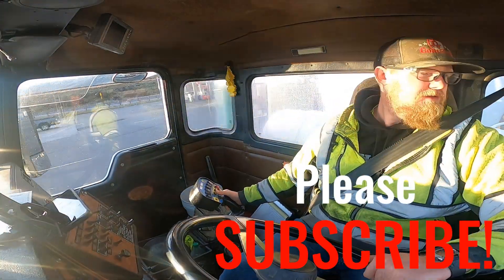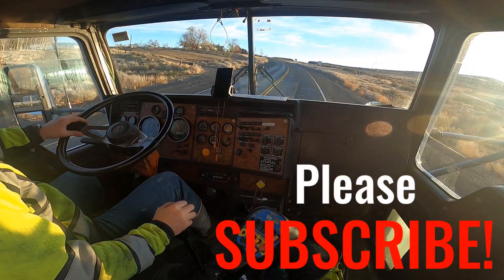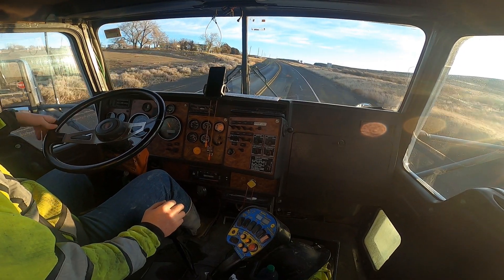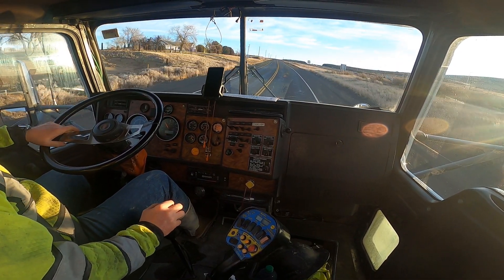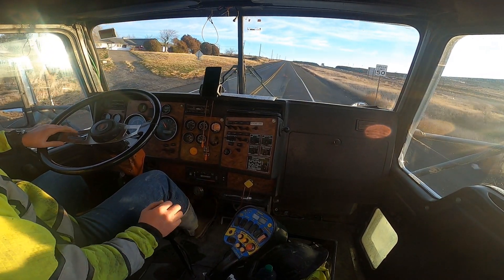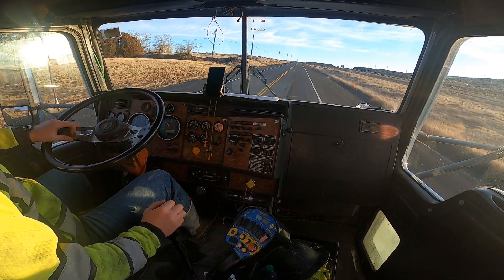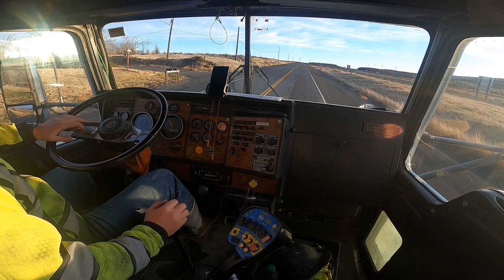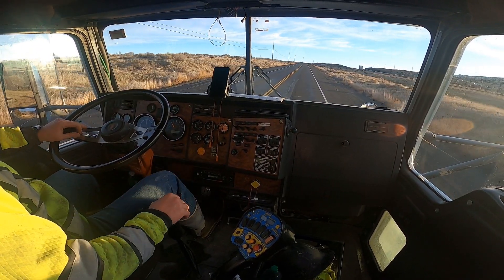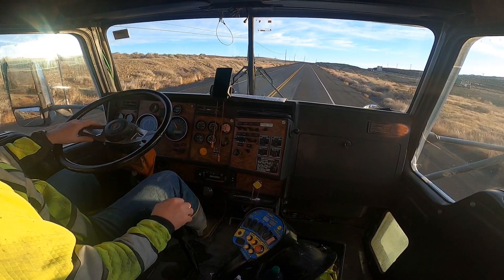They ordered a six-inch slump — let me speed up the drum a little bit. A slump is just how you measure the consistency of concrete. Basically, the higher the number the wetter it is. So if you're doing a curb or a foundation and you want the concrete a little dry, it's usually about a three or a four — that's sort of like oatmeal. You can work it but it stays where you put it.